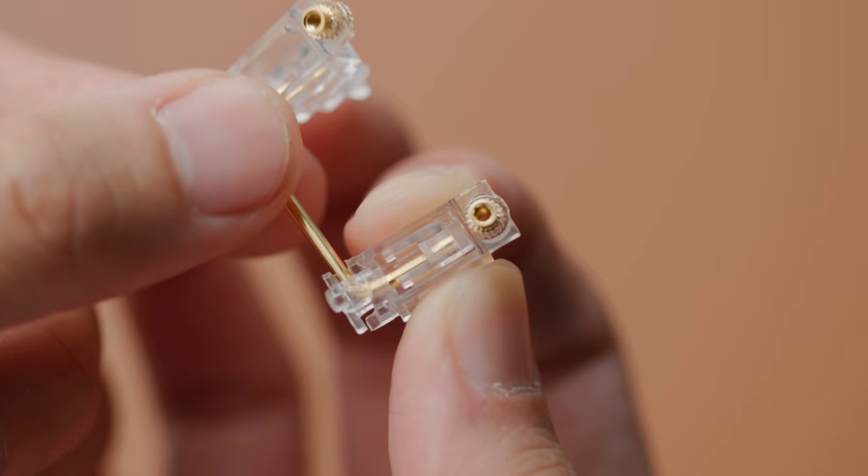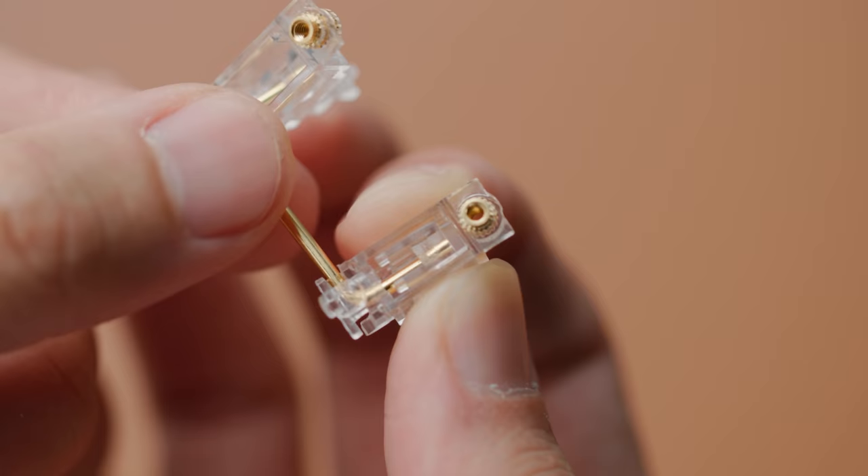Once that's done, it's time to lube the wires. The main culprit of rattly stabilizers is the metal-on-plastic action of the wire hitting against the insides of the stabilizer stems. The best remedy for this is to essentially fill the gaps inside the stabilizer stem with a semi-thick lubricant, so that the wire still has some freedom to move around, but will experience some resistance such that it won't hit against the inner plastic as quickly to generate that rattle. For this step, I recommend you use either Krytox 205 Grade Zero, Dielectric Grease, or SuperLube. Using any thinner lubes will prove to be not as efficient in restricting the movement of the wire, and going with thicker lubes may restrict the wire's ability to move too much to the point it makes your stabilizers feel sluggish.